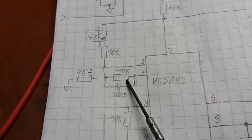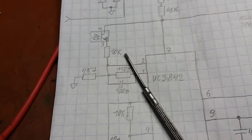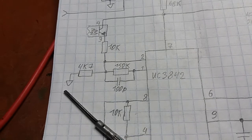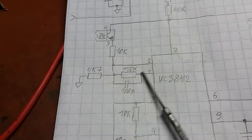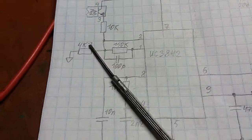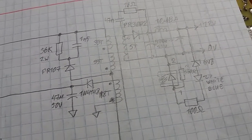This little network makes sure the error amplifier — which has its input on pin 2 and output on pin 1 — is properly compensated. It's a negative feedback loop which makes the circuit more stable, because if you use it as a comparator without any feedback it will react way too fast, go into oscillations, and create an overshoot at the output when loaded. That's not something you want.